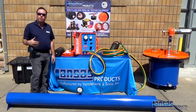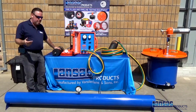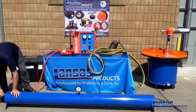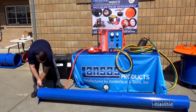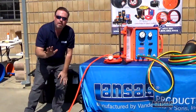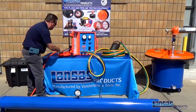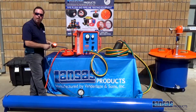The first step in doing a line acceptance air test is to install your back plug and inflate it to seal one end of the line. Always remember that safety comes first and foremost. Make sure you have some kind of blocking and bracing to secure your plug from being dislodged from the pipe. With our air source we're now going to inflate the plug.